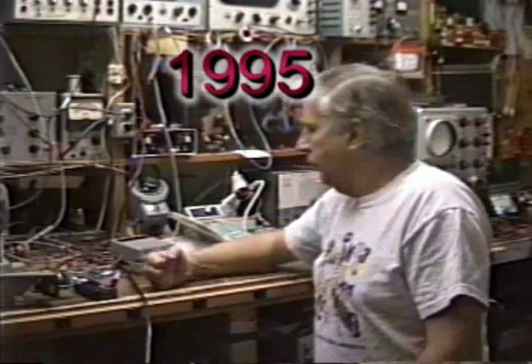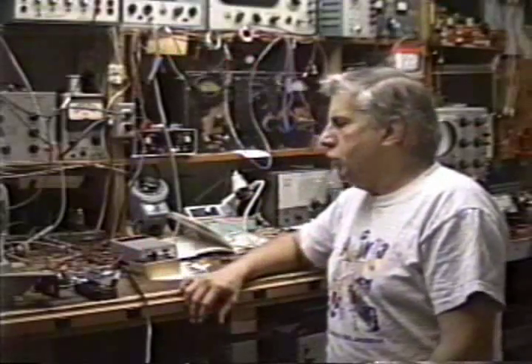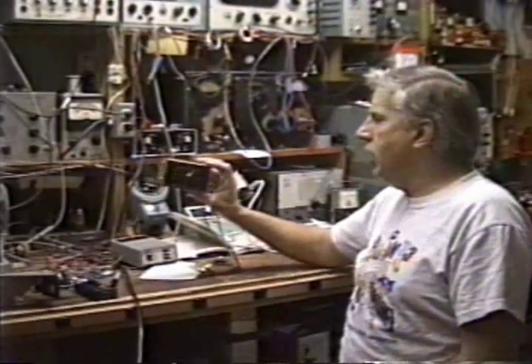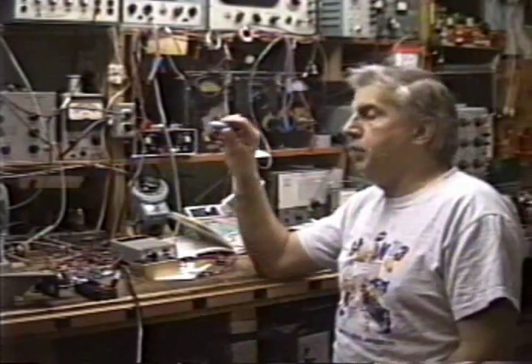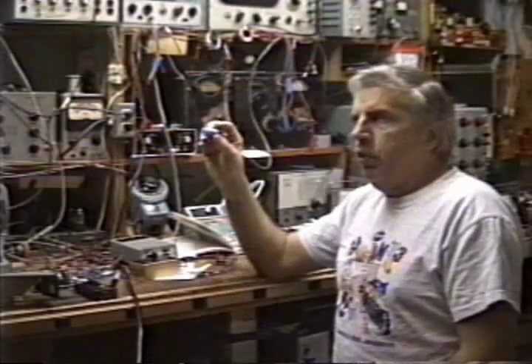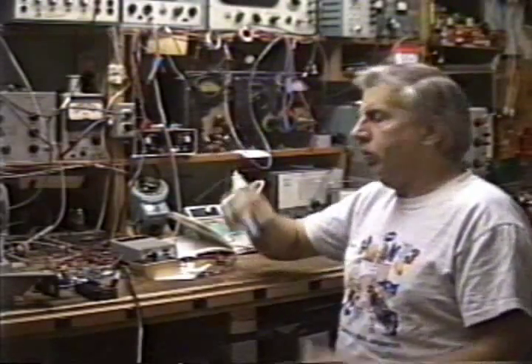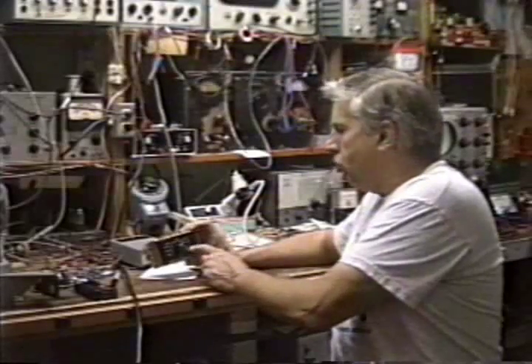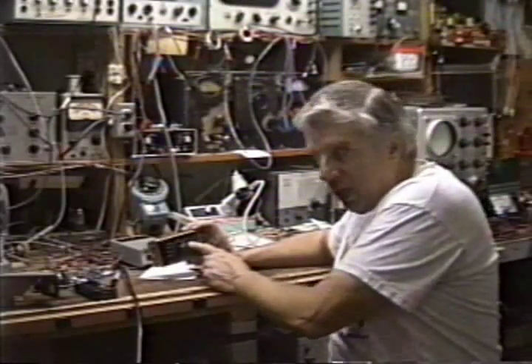What I'm going to attempt to make here is a dripping faucet. It's nothing more than an oscillator circuit which pulsates on and off. The oscillator time constant is governed by the capacitor discharging through the circuit and recharging again. The larger the capacitor — now we're using small capacity here in this substitution box, up to 0.22 microfarads, two-tenths of a microfarad, which is very small. We're talking 2,200 microfarads in this electrolytic here. Putting this in the circuit will give you that drip, drip, drip sound — you will hear the difference versus just putting in a capacitor of 0.22, 0.1, or 0.047 microfarads.